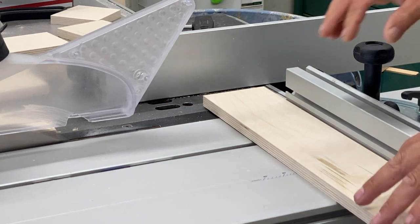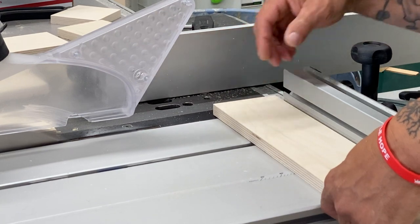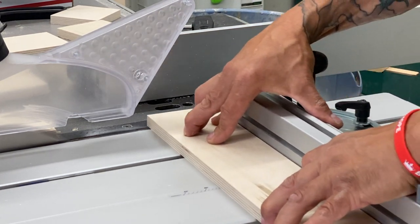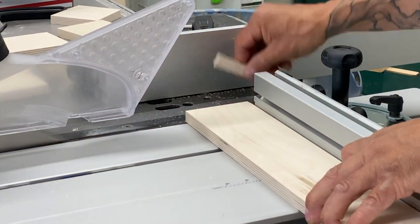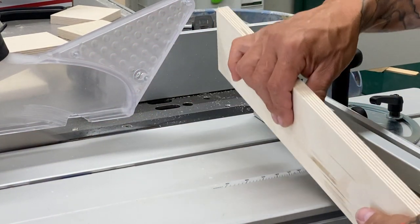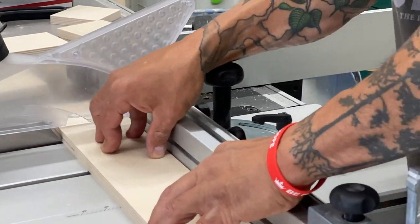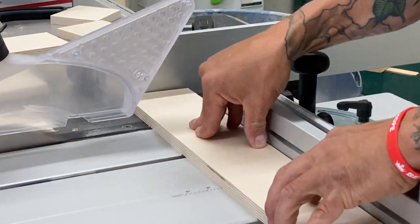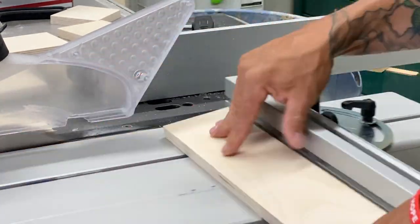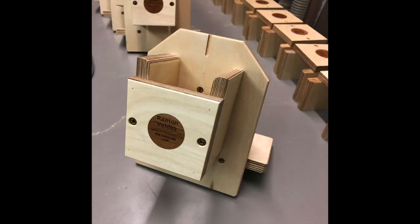What I've got going here are some two-degree cuts on each side of these pieces — these will make up the front piece of my domino docks. I start by making a trim cut at two degrees. I wanted to show that even tiny little pieces won't get wedged in the blade, thanks to my zero clearance inserts — I'll show those in a bit. With my auxiliary fence set at two degrees, I simply make a cut, flip, and keep on doing that. Nice clean cuts on both faces. There's a good shot of the domino dock with the two-degree cuts on each edge.